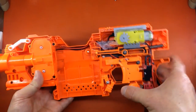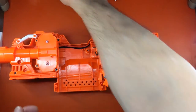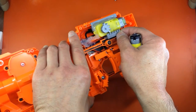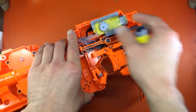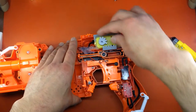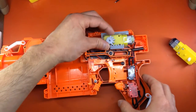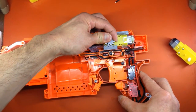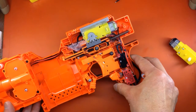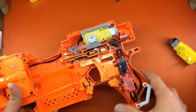You can see we've got a lot of hot glue in here, but that's because this is just a working prototype. The only parts that are really custom here are the rack gear, as you can see, and this pinion gear, which has about two-thirds of the teeth removed. You need to make sure that they line up — this is one of the things they figured out with the Taobao kit. With this five-tooth gear, here is the alignment that allows it to function properly.